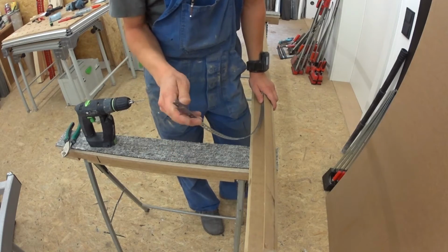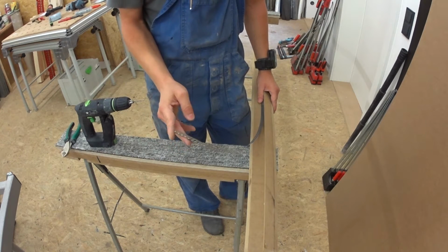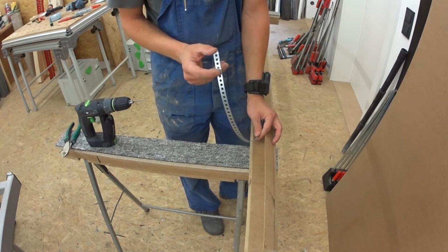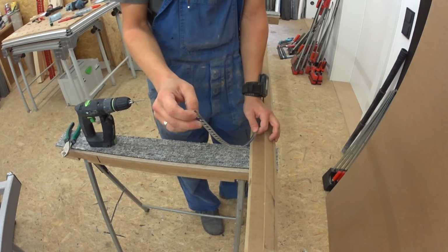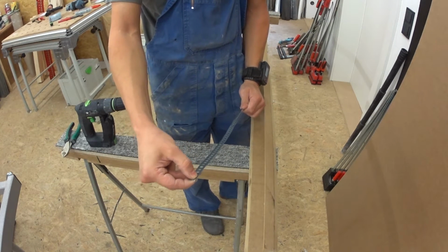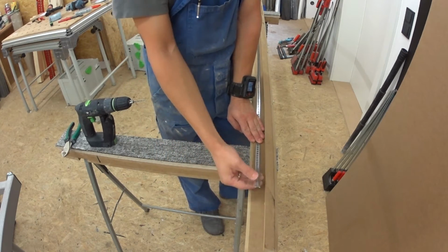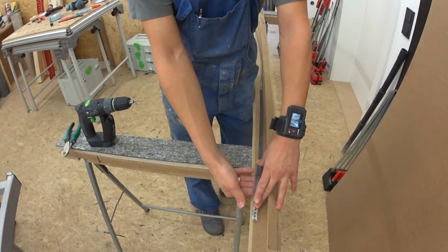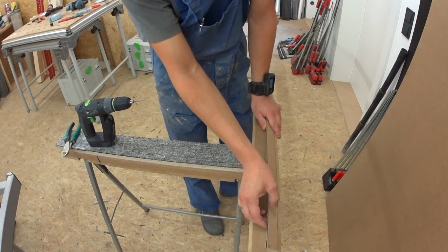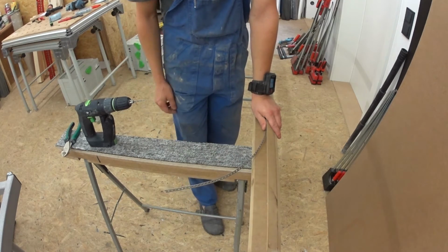We're going to use some high power RGB LED strips, so those need some passive cooling. For this purpose, I personally like to use this sheet metal perforated strip. I don't know how it's called in English, but that's normally used for mounting purposes, so you can screw something to the wall, some tubes or something. And this is, in my opinion, perfect for this purpose. Just screw it on here, stick the LED strip on, and you have perfect cooling.